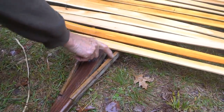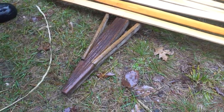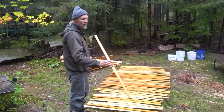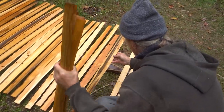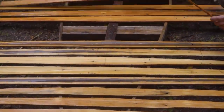We're going to mark these where this crosses here and comes right down to here. The last rib's going to sit right there, so that's got to be made out of spaghetti. But the grain tells you a lot — wide grain will take the bend, but it'll be a weaker, softer wood. But down here it doesn't matter. And tight grain will make a nice harder wood, a stronger rib.